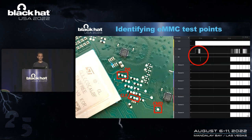The next step for me was to extract the firmware from this dish to look at the software and maybe find an easy vulnerability to get into the dish. To do that, I had to extract the EMMC memory. There are several ways of doing this — normally I would extract the chip from the board and then dump it that way. I didn't want to do that because I was afraid of breaking the board, so I soldered wires to all of these small test points, hooked up a logic analyzer, and restarted the dish. From this logic analyzer trace, it's very easy to spot which test points you need. To read an EMMC chip, you only need a clock, command, and D0 line.